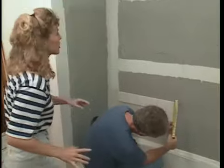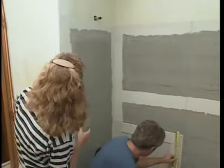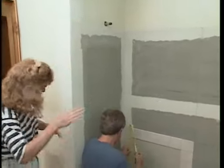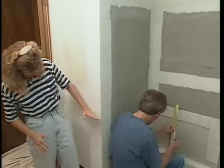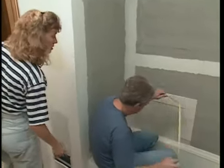For our walls, we're starting with the back wall and the tub surround. We're bringing our tiles up 6 feet 6 inches high, which is about right here for all 3 walls. And then we're going to jump down and go up to wainscoting height, which will be about right there for the rest of the room. Okay, I need 6 tiles at 2 3/4.